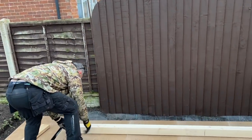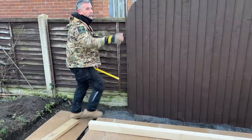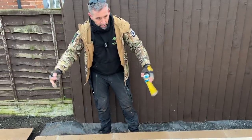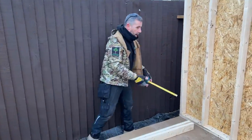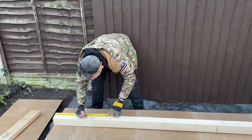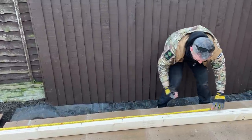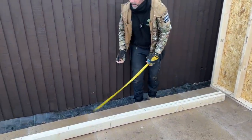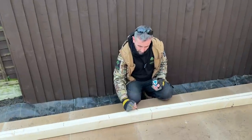If you watched yesterday's you'll know I do them at 400mm centers. It didn't really matter which side I started on that wall, but on this side it does. For clarity, set the timber up in the direction it's going to go. I'm using the sheets to square the wall — I want an overhang on that side, so it's difficult to create a square with an overhang there, so I'll start boarding from this side and work that way. With that in mind I'm going to start my 400mm centers from that side. If it's a precise measurement I'll use a pencil; if not I'll drop to the Sharpie because the eyesight isn't great. I'll write on them so you know what's going on — that's my base plate.